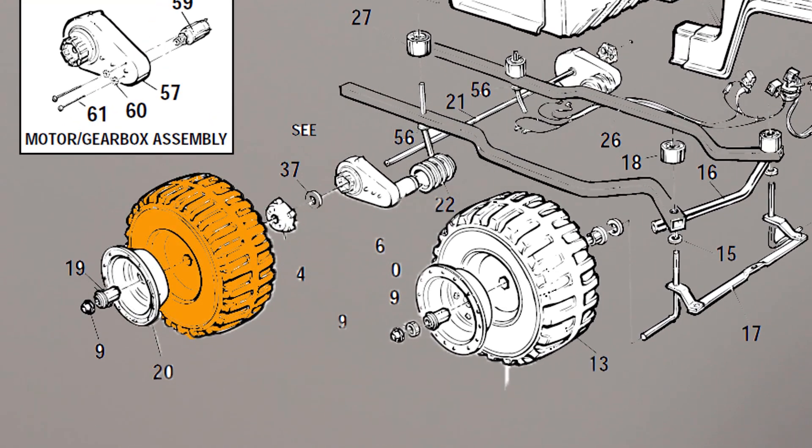Three main parts were used to develop the drive wheel adapter: the original plastic wheel, the embedded drive gear, and the new wheel. The new wheel's rim is tapered from the hub to the tire. Making sure the adapter fits flush with the rim angle and snugly on the hub's diameter reduces any side-to-side torque.